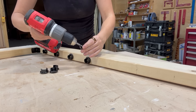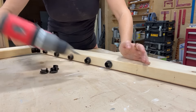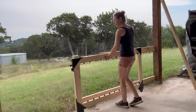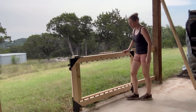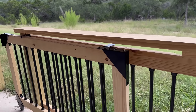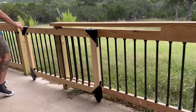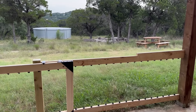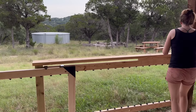You can make the inside of this gate look any way you like because the hardware is doing all of the function for you, so the inside is just aesthetics. On the railing system, an attachment that is sort of like a hook is attached to the rails so that the gate can easily slip up and under it. A matching hook is installed along the bottom so that the bottom is also captured. The main thing to pay attention to with a sliding gate is that you need enough room for the gate to open fully — however wide you want your gate, you need that same amount of space to the right or left side. This hardware can go either direction, but it needs a slot in the railing, so plan for that when building out your railing system and before putting on the top cap.